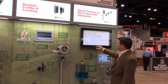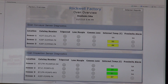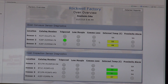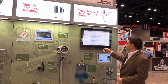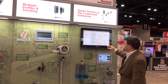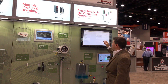If I drill down into panel number one, for example, I can take a look at the status of all the outputs — whether the lenses are dirty, if there was a comms loss, maybe a cable was caught, or the sensor has been physically damaged. I can get that information very quickly on a dashboard. I can also look at the internal temperature of the different sensors. I can go back to the initial dashboard and look at another facility very quickly and drill into those particular sensors to find out the health of those.